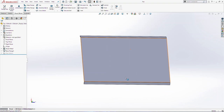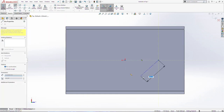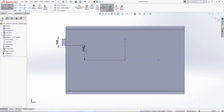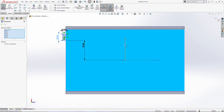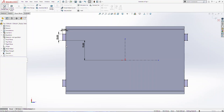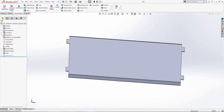On this plate we are going to make our grill — we are going to do the grilling here. Then we need a rectangle: 23mm, 70, and here is also 10mm. We are going to use mirror entities. I will use the shortcut and we are going to create one tab with base flange and just click OK.